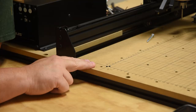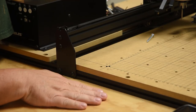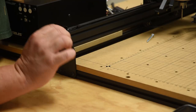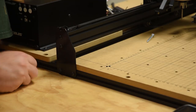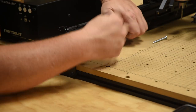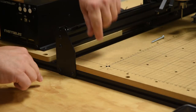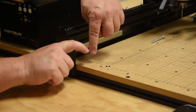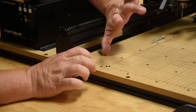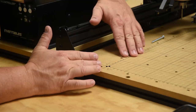The second step is the MDF base. MDF is a very good substrate for this kind of project — it's very uniform in the way they manufacture it. It's basically sawdust and glue compressed together with a little film of shellac on top. But because it is sawdust and glue, it's going to absorb and release moisture from the air, so there is a chance of a little bit of movement. My wasteboard is anchored down to the frame rails just as the factory tells you — three screws in front, one on either side, and three in back — which means the corners are not anchored down. Every single one of mine has a little bit of flex, which means if I anchor something down using these screw anchors, it's going to be kicked up on the sides.